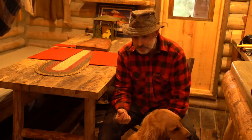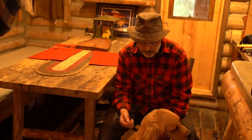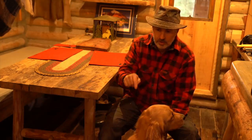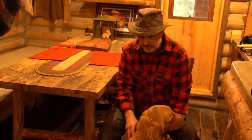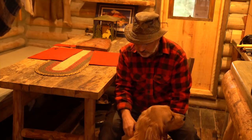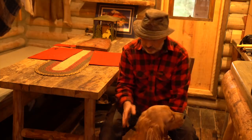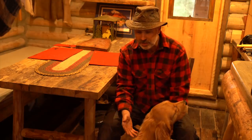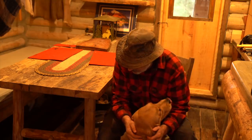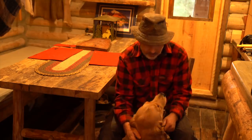And even using spiral nails, I didn't have screws at the time, I just could not get those boards down and get them flush and get them to stay that way. So I still have little edges in places. And then because I had to fasten it down, the boards continued to shrink. So I did get these gaps, and they were bad enough in some places.